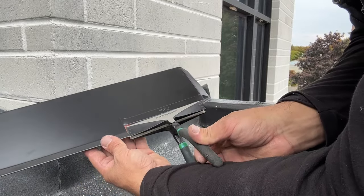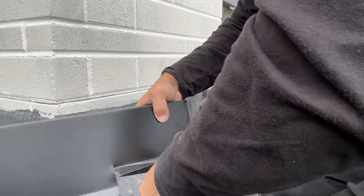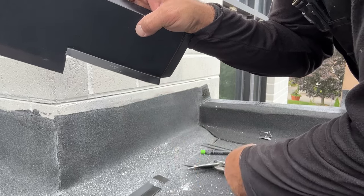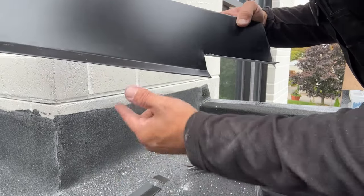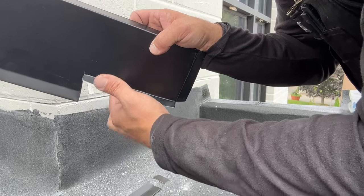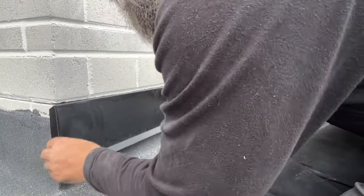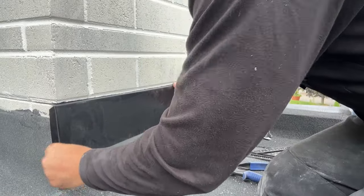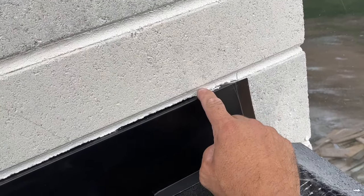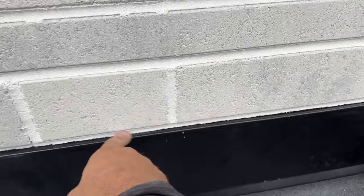I'm going to take our folders — this one we're actually going to bend back out, and you'll see why in a second. So that is going to sit on top of the parapet with this one-inch tab coming down. You could technically bend this all the way around and make a safety hem like on the rest, but I like this sitting down so whoever's doing the parapet capping can either tuck underneath that or go over top of it, and just caulk that corner — it leaves some options for the people doing parapet capping. It's fitting really good, nice and tight, with the reglet all the way across. You can see where we had to miter the top of this return into the reglet because the saw blade doesn't go all the way down — that's why there's that tiny gap there. After this, we will be caulking all of it.